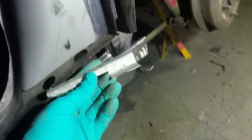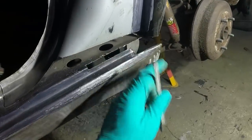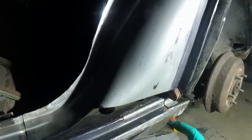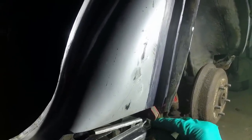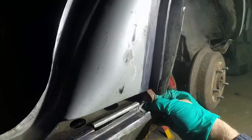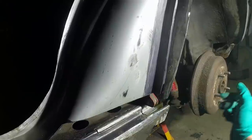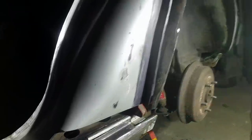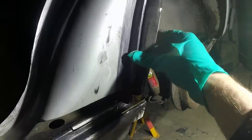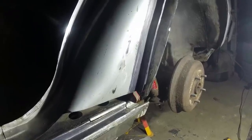So that's my rough cut bit to go in there. I'm going to take it into the workshop where I've got the vice set up and just hammer that corner a bit sharper, then trim it and weld it in. It's in there with one small magnet holding it. Annoyingly, I've sanded off far too much of the metal here so it does fit, but just not as neat as I would have hoped. I think I sanded it to try and get a nice gap for good weld penetration but it's a bit too big. It's not the end of the world - I can shape this out. I'll just go and get the welder, tack it in, and then see how the final fit is.